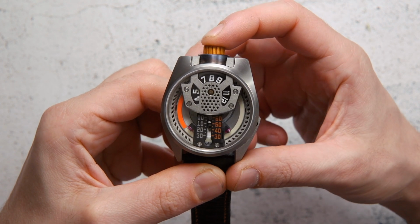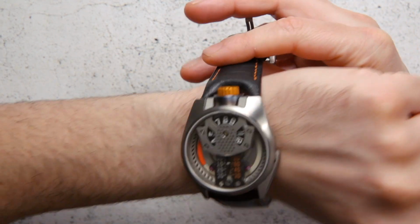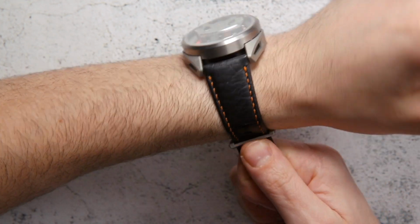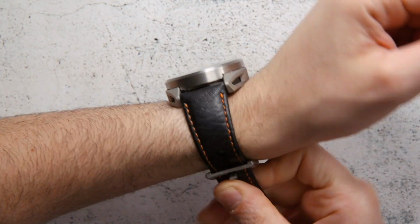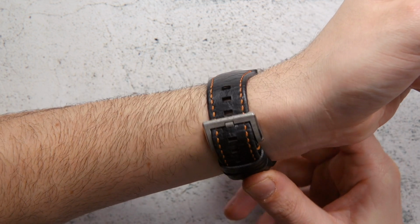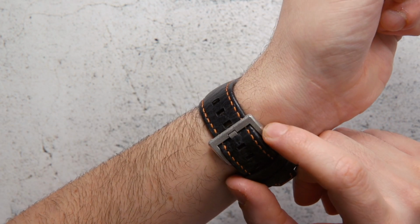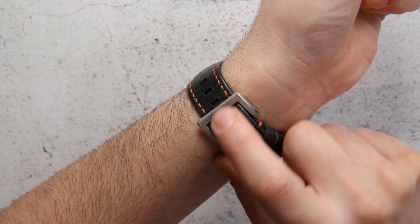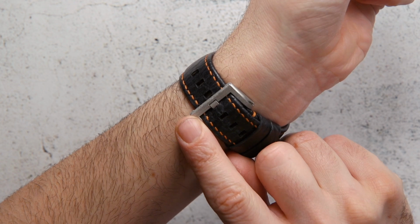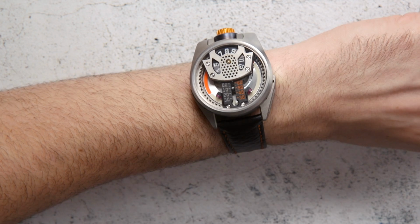Again, the case is about 44 millimeters wide in titanium with a combination of traditionally CNC'd elements as well as 3D printed elements. Now, 3D printing is a very interesting and wonderful area of technology that's going to get more and more sophisticated and applicable to the watch industry. It's semi-applicable. The reason I'm holding it on the strap here is you could see that this strap, I hope you can see some of the texture here, is also binder jetting made, and you can see a little bit of interesting texture. It looks a little bit like Damascus steel, to be honest.